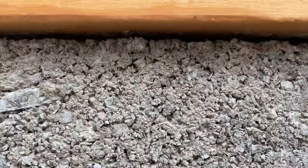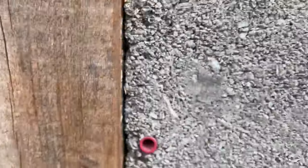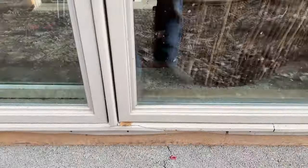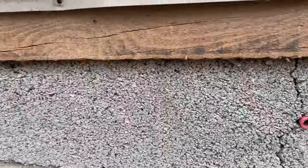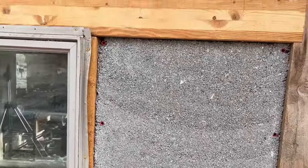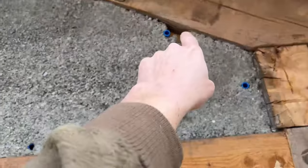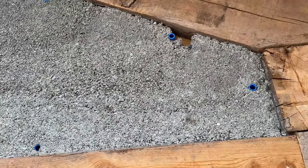Here is the gapping along that framing member and along the edges — about an eighth of an inch or so in most places. Where I have some framing members I've got a little bit of cracking here and there. I've got a strange crack here which I believe is a cold joint — I think I stopped there for the day. I don't recommend cold-joining these walls; I would say run an entire wall section in the course of a day.